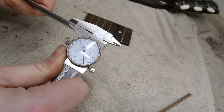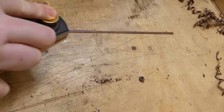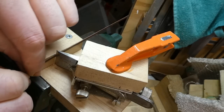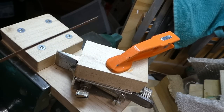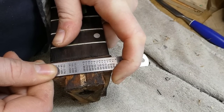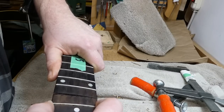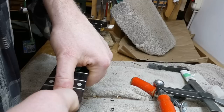Back to the J45 neck. Before gluing the fingerboard back together, I have to make a shim the same width as a saw kerf I used to separate it. With a hand plane I can get it down to about 25 thousandths — just over half a millimeter — then take it the rest of the way with my veneer scraper. It's so finely calibrated that I can take off less than a thousandth of an inch with each pass and get something of very even width. I'll fill the space under the fifteenth fret, then glue a strip to the end of the fingerboard.